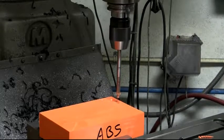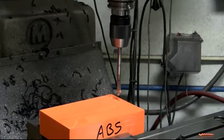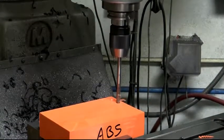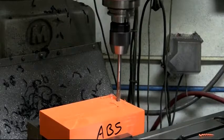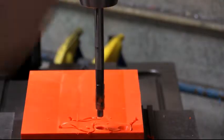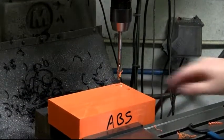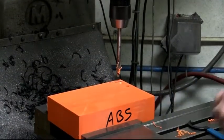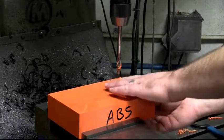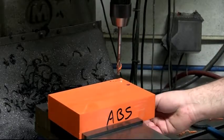The reason for that is our 1/4-20 socket head cap screw, its head is about 1/4 inch high. So by doing so, we're now going to put it about 50 thou below the surface. We're going to come off, carefully wipe our chips away, and this should drop in there just perfect. And there you go, you've got the head below the surface. Everything fits nice and smooth.